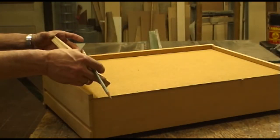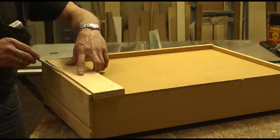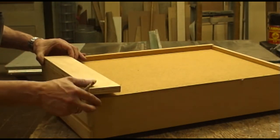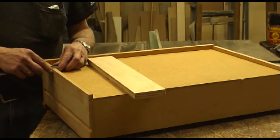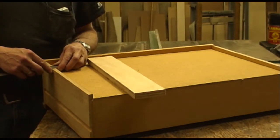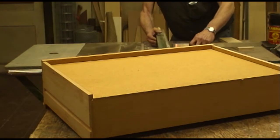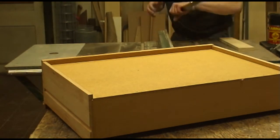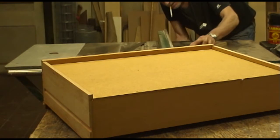Alright, so I'm taking a piece of 3/4 inch plywood, which is actually closer to 11/16, and I want to cut a dado in here so that this sits over this like this and gives me a straight edge to route against. It's really just under a 1/2 an inch, not quite 11, not quite a half. We'll go a 1/2 inch to the outside of the blade. No, we're going to go this way, 1/2 an inch. And the height, I'll just set to my line.